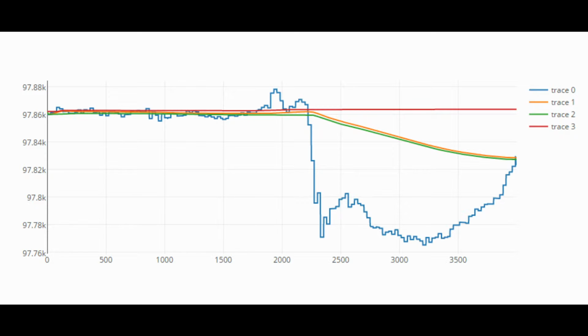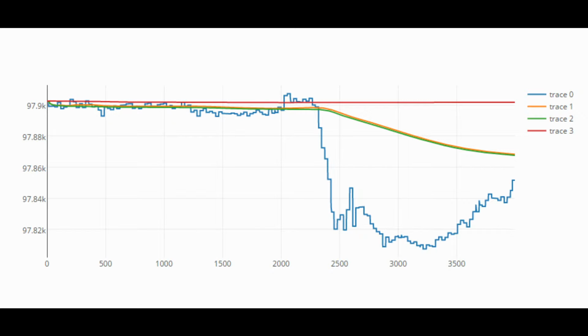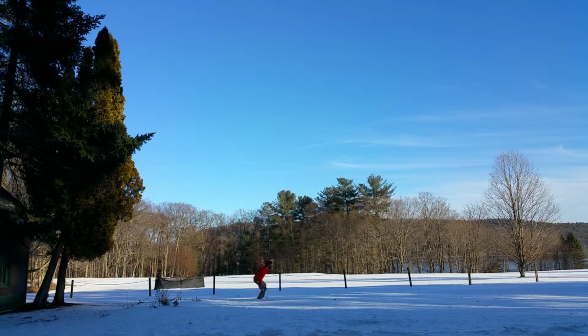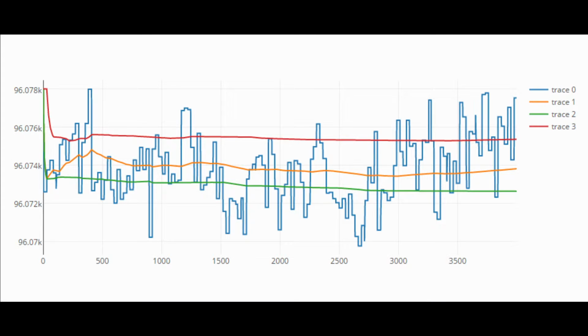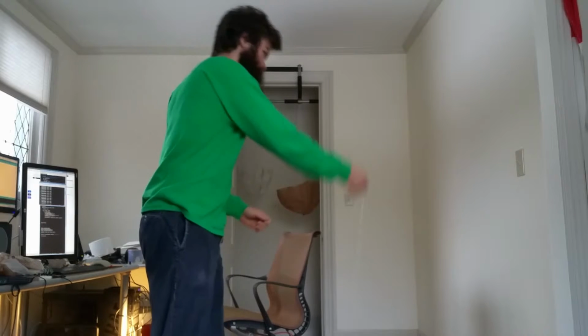Pressure readings change day to day with the temperature, so I needed a system that was agnostic to any relative variation. To detect this, I took 3 running averages: the total average, a low average, and a high average. Any incoming value lower than the total average would be averaged into the low average, with the total average being averaged into the high average that cycle, and vice versa. The parachute would release when the pressure dropped below a large enough multiple of the difference between the high and low average, effectively letting me use the noise as my release constant.